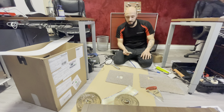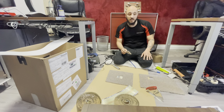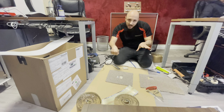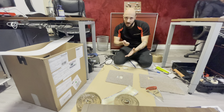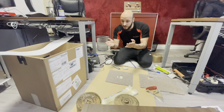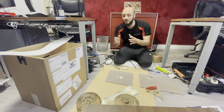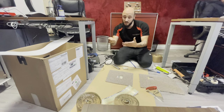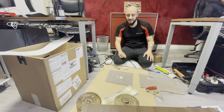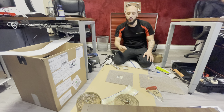But generally speaking, it can get you out of some crazy trouble, and it can get you to get your joint bang on, then place the tool glide on top. Whereas when you're working with the traditional heat seam iron, you've got a few seconds to make that work, because as soon as that carpet hits that glue, you can't really do anything else. You might be able to manipulate it here and there, but you only have a few seconds. With this, you just put it on, press play, take it off. If it doesn't work, put it on, press play again, redo it.